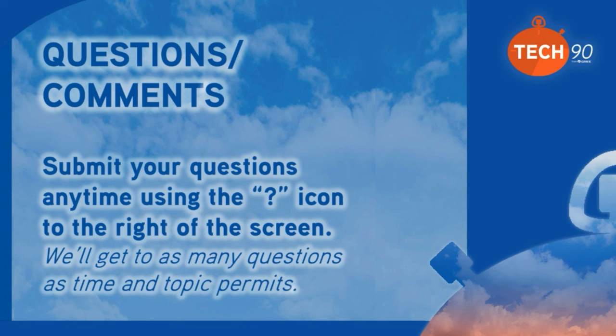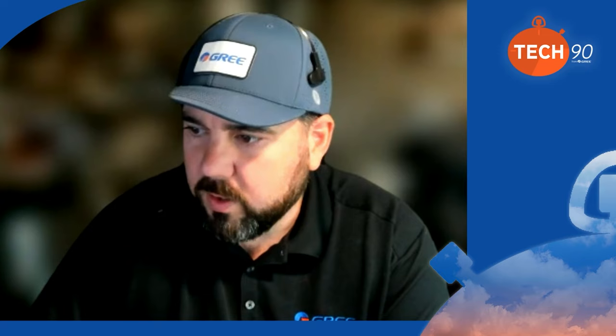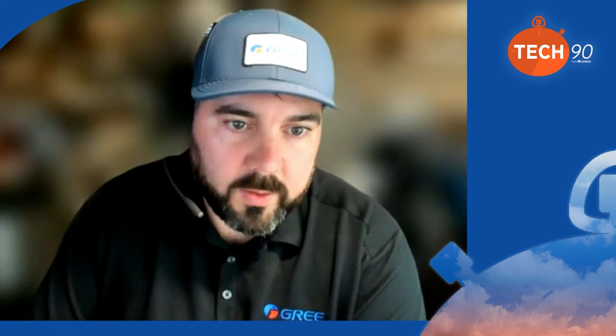So Craig is asking, he's considering doing a change out of his existing split and putting in a Flex. He wants to leave the high efficiency furnace since it's not that old. What are the system requirements to put the Flex with an existing furnace and coil, which is a great question. There are just a couple little things we need to make sure we do. One is make sure that the coil that's there has a TXV, right, Greg? Yeah, that's one of them.